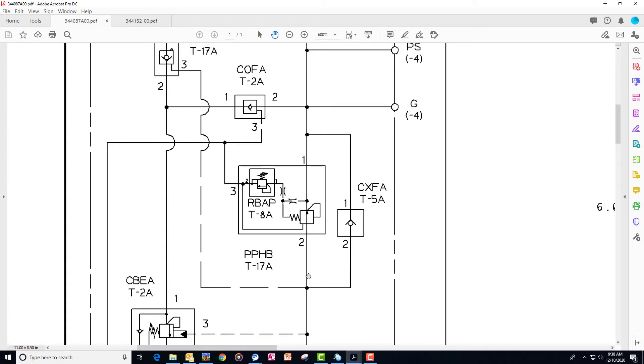So how it would work is we had opener down pressure before the pressure reduction valve — basically sitting at tractor system pressure when we're engaged in a down position. It would open up this check valve and allow the openers to move up and down to the adjusted relief.